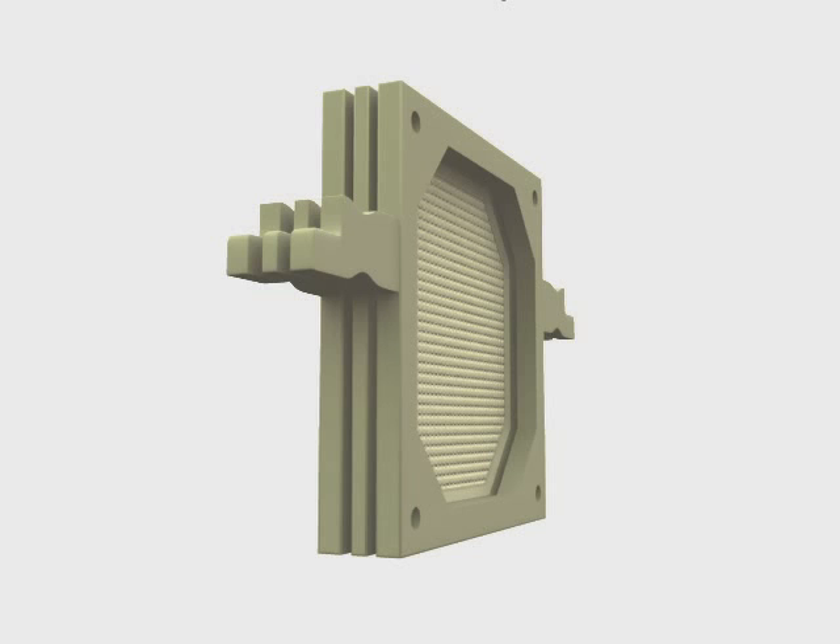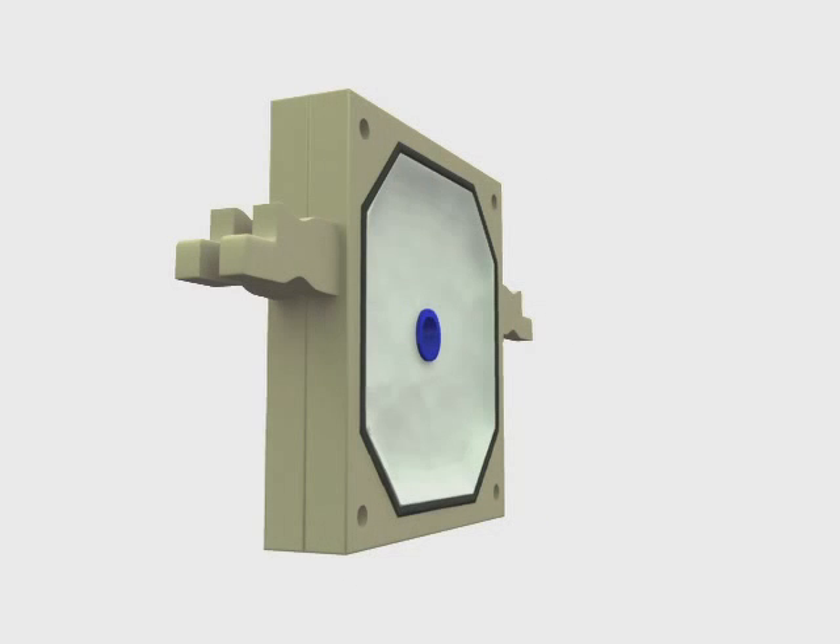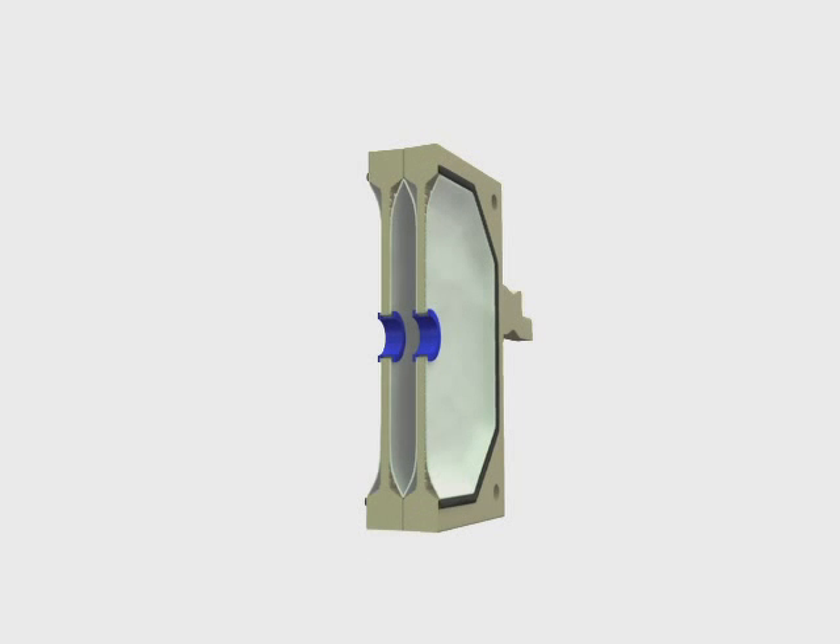Micronix filters may be configured for specific plate designs to suit the particular dewatering service required. Plate and frames: a filter cloth or paper is draped on the plate and cake is formed within the frame. This type of plate configuration is used for applications requiring paper media or for polishing applications. Recessed plates, when placed together, form a cavity for cake formation. The one-piece design improves plate strength, allowing higher filtration pressures and automated plate movement.